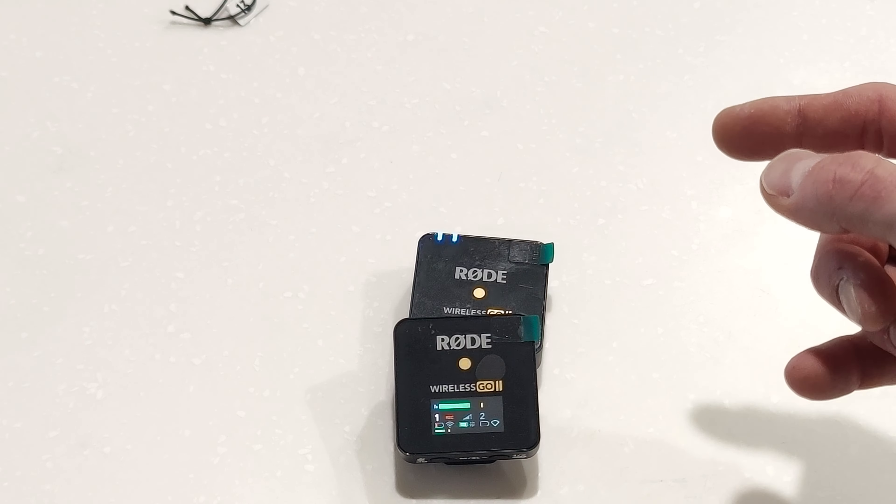It's set to always record mode, so this is recording as long as it's turned on. You can also set it to backup mode, which only records when it's paired — that way even if you forget to hit record on your AV equipment, this thing's still capturing audio. The left button is your decibel adjustment — cycling through minus 12, minus 18, minus 24, with minus 12 as the default. The channel selection button lets you choose one, two, or none, adjusting gain or muting that channel, and you can hold both buttons to split back into two modes.